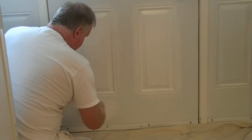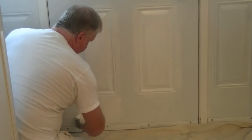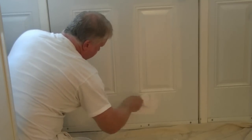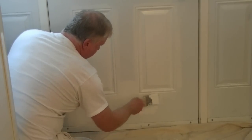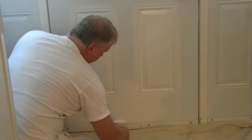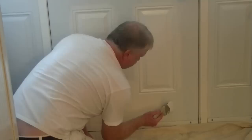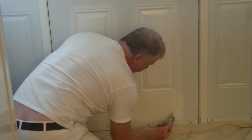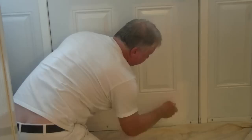We start at the bottom, we start in the middle, we work our paint out, we go up to that panel and then we go down to our weather strip. So you can see it — we want to brush down into that and continue to brush horizontally. We put a little bit of paint on our brush, brush through the horizontal panel, then brush vertically through there and create an imaginary join at this point.